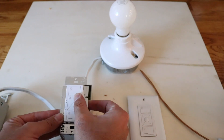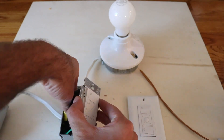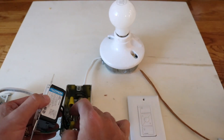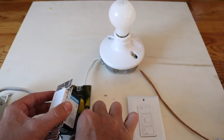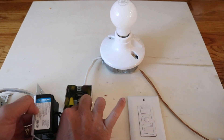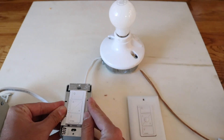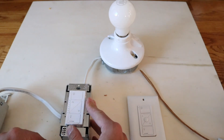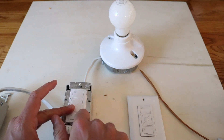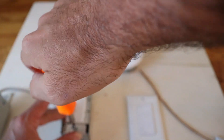Just in general, these Lutron light switches are really high quality and I do highly recommend them. One thing you're going to notice though is that any smart switch does have a lot more depth to it than a typical light switch, so you are dealing with some space issues sometimes in the junction box. What we've got to do is kind of do a little wire origami — fold those down — so this will go in there nice. Now we've got it in there. I recommend just taking your time when you are trying to get those wires in the right place; it does help to just fold the wires a little bit.